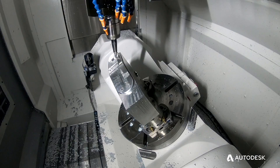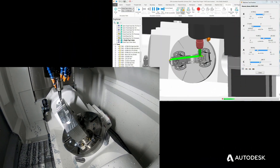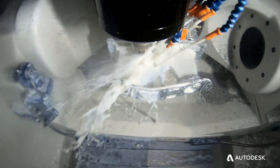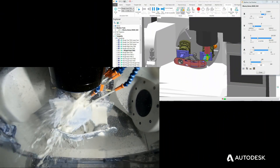We were not able to use the side of a tool to machine this surface right here, so we had to angle the part and use a ball mill to machine that. Also, making sure we could reach the side of the parts — it's a very narrow part — required some long tools, and then you have clearance issues around the trunnion.